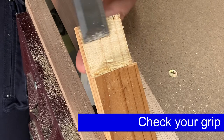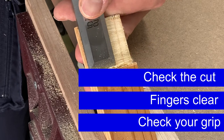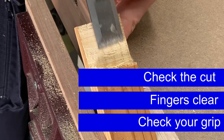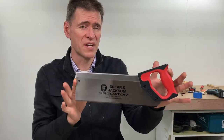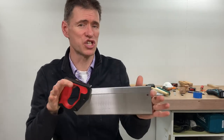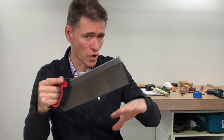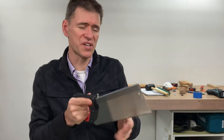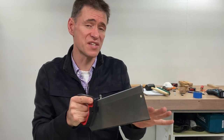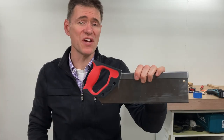So for the most part, remember to keep your grip right, your fingers away from the teeth of the blade, and check your cut regularly. Try to keep it straight and keep practicing. That is a quick overview and introduction on the tenon saw. With most things it takes time and practice to get them working just the way you want. But most importantly, remember to stay safe by never cutting across your fingers — try to keep your fingers in line with the cut. That won't necessarily guarantee safety but it will do a lot less damage. Stay safe and we'll see you in the next video.